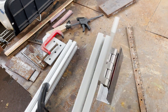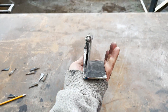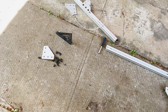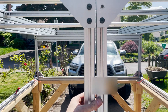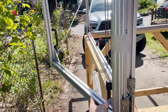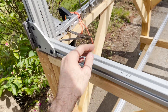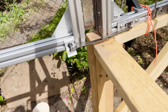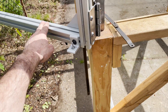Now I'm in the process of making my new hinges. All things considered, I think they turned out pretty good — they'll fold flat and then open up to 270 degrees. I'm cutting off just a tiny bit from each side because I'm having some clearance issues, then mounting everything back up to see how it looks. I've got a nice little gap now which I can adjust with this cable. These open all the way out nicely. I'm rigging up this little door catch and it works surprisingly well — it opens up and locks, keeps the door from opening all the way, and then just lift it up and push it over whenever you want it to open the full length.